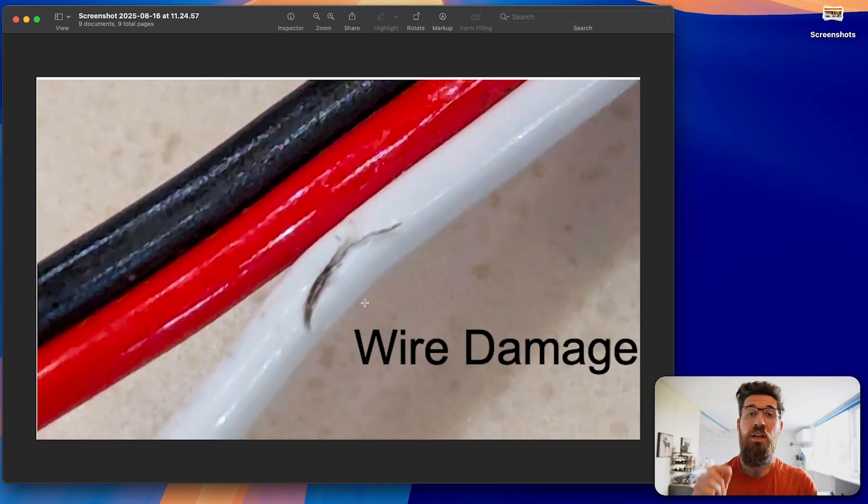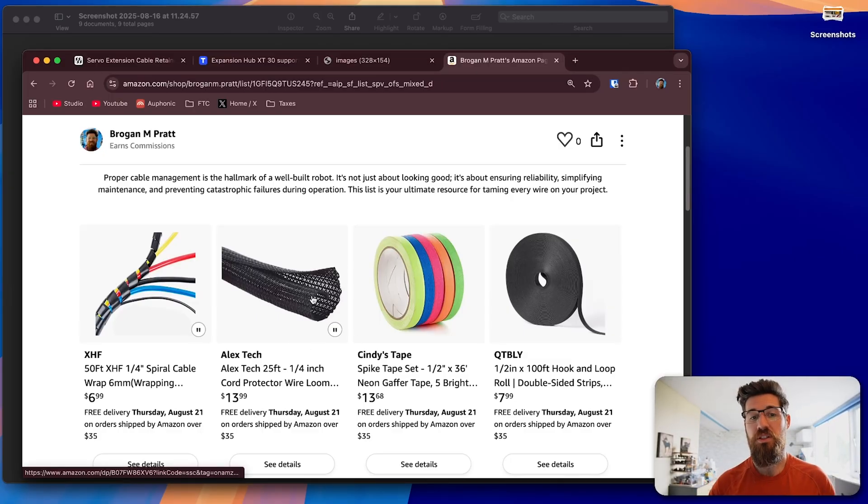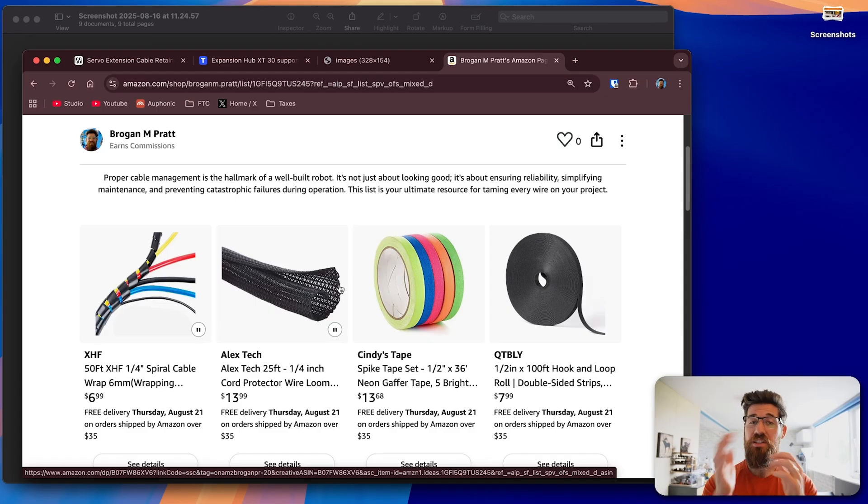Always wrapping your wires and making sure they are constrained in some sort of cable sheathing really helps protect them. I really like wire wrap sheathing for this. If you're looking for a step-by-step tutorial on how to wire a robot, I've got a link in the description for a full step-by-step where I wire up an entire competition robot. When it comes to sheathing, I prefer this cord protector — it's a sheet of plastic wrapped around the cables. It helps protect your wires from pinching because it's a little wider and there's less likely chance to pinch the wires inside.